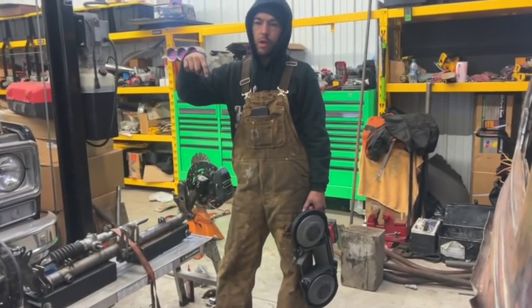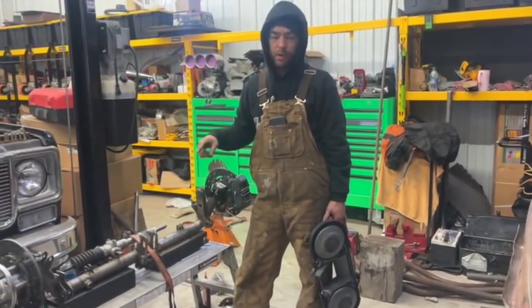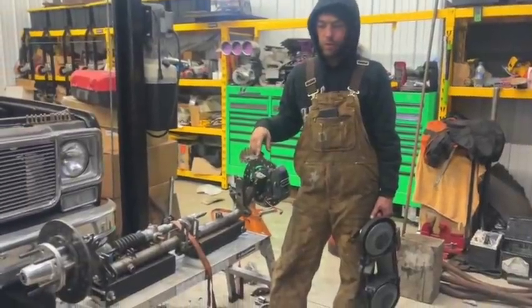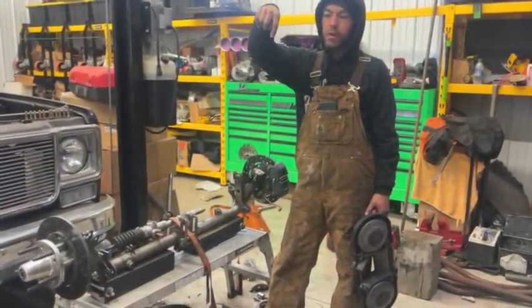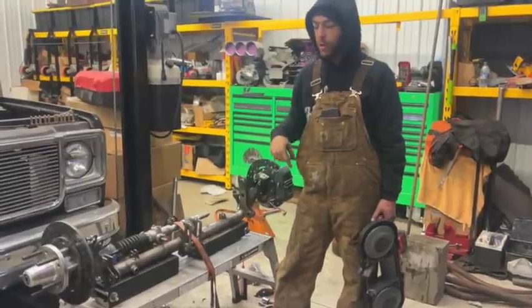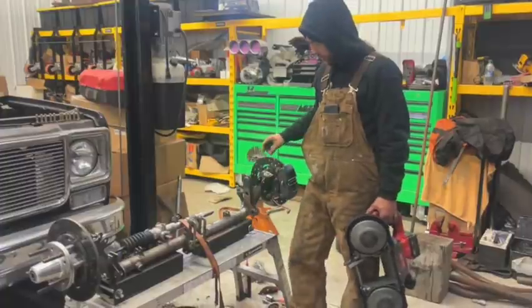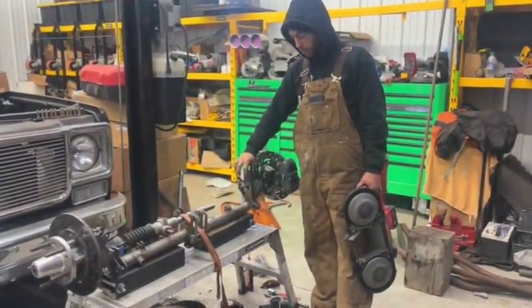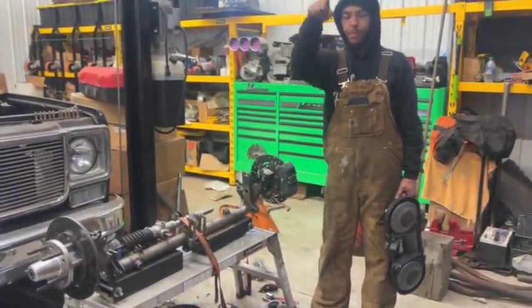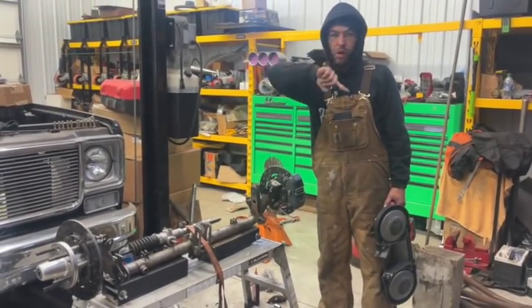I welded a 3/4 inch bolt and a 5/8 bolt at the center that we needed them. I think the front bars are like 26 inches long or something like that. So I welded two of them, let's say a 26 inch center. Then I adjusted all the ladder bar, or four bars, so they all fit on there. Okay. Then I went in here and put the four bar in here, and then I scribed it on the chassis. And I did the same on the back, so there was an arch.